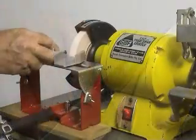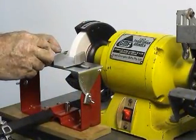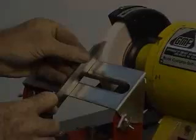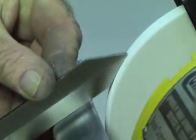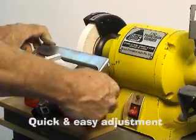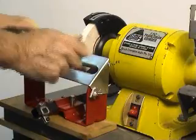The slide wheel is also used to precision dress the grinding wheel. This is essential for perfect grinding results. The ample proportions of the table provide excellent support for a wide range of tools. The top plate features precise angle settings, notched with handy scales throughout, enabling you to quickly find your favorite grinds.